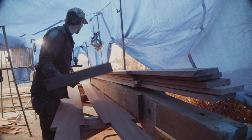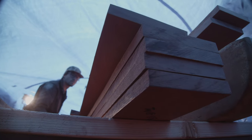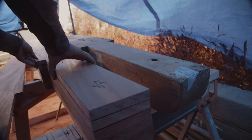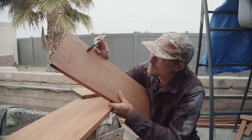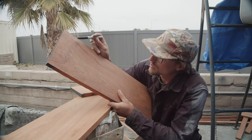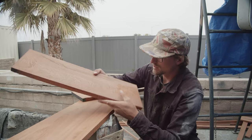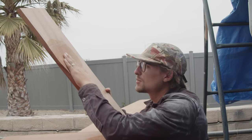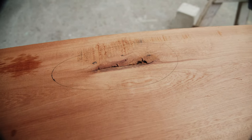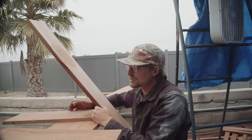Individually cutting all the planks before gluing them together made the process go a lot smoother because I was able to start before it was a gigantic hunk of wood. Some areas on the planks were not so great — splitting in the middle around a knot, wood checking. I made sure to cut away from those areas. Another board had a really giant low spot and some small knots, so I made sure not to use that section. In doing that we had just enough wood to get us through the project.